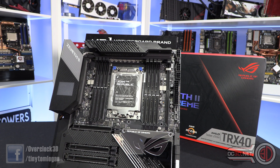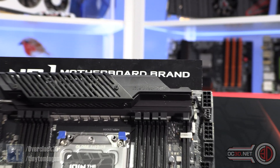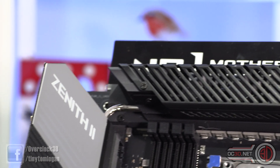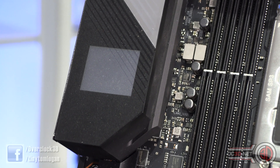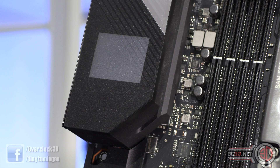That's quite surprising because the Asus is pretty much the only one that doesn't have the micro-fin heatsinks completely covering both the top and the side of the board. They have a relatively standard-looking heatsink from the outside — a large chunk of aluminium. Normally at this point I'd have a Gigabyte rep saying Asus don't have the temperature probe actually on the PWM, on the MOSFET body.